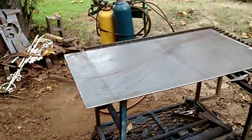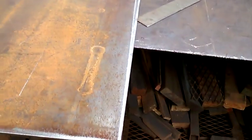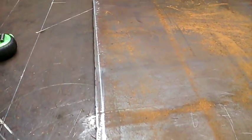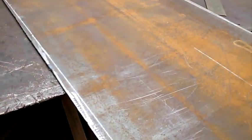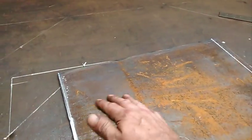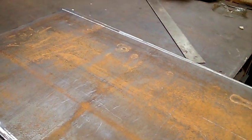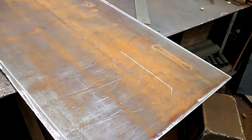Let me show you what I did. This is one of the side panels - here's one already squared up. Can you see that chalk line on there and the one on this side? That's how much this thing is out of square. You see how it gets down to nothing on that end and comes back this way? Even though this thing measures the same width-wise on both ends and the same length-wise all the way through, it's still out of square bad.